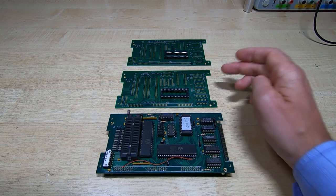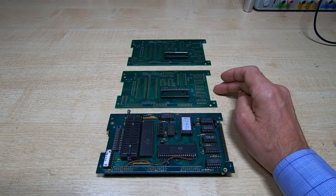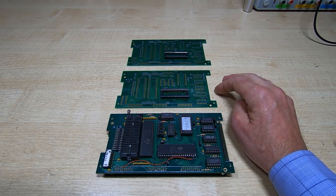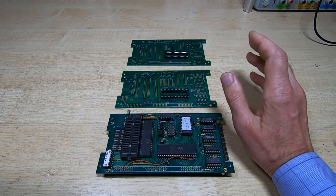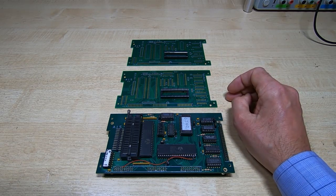The problem is that although the boards are supposed to be bare board tested, there appears to be a short on some of the boards. It may not affect the boards you have, but certainly if you're having problems with the build, then you should check this — it may be the cause of your problems.